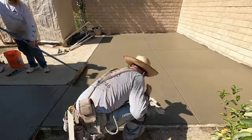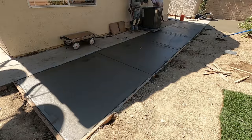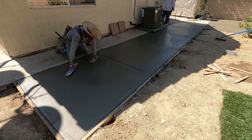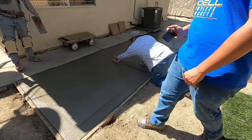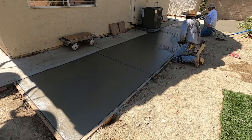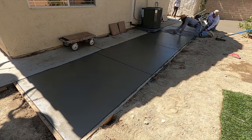You can see the broom going right behind the sliders, following up the trowel guy. When you stay close to whoever's troweling it out, if you stay close to him with the broom you won't have to use any water on the surface — there's enough moisture in the concrete if you keep close to your troweler.